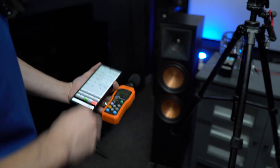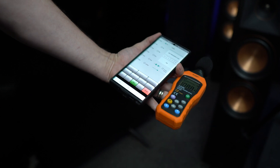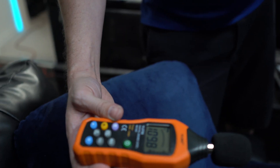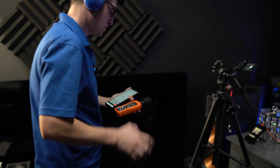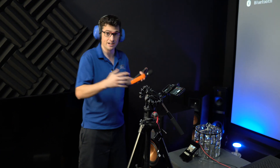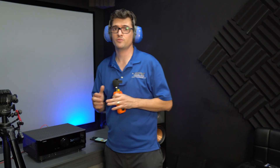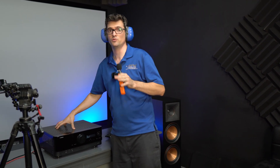Let's get this going right now. We've got our hearing protection on because we should exceed over 100 decibels right now. So obviously at the higher frequency response, it's not going to need as much wattage. That's all the speaker needs at that point to push out that kind of power — 28 watts. A lot of people always think that high frequency responses take tons and tons of power, but that's just not accurate.